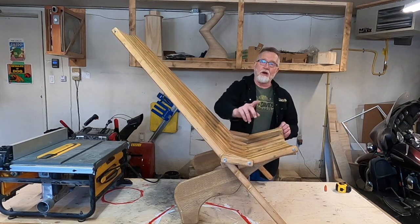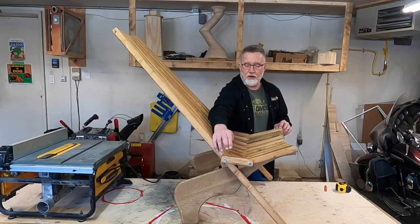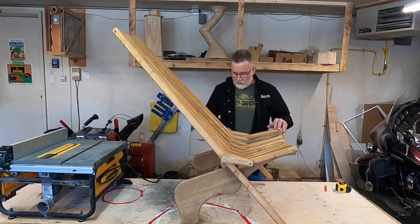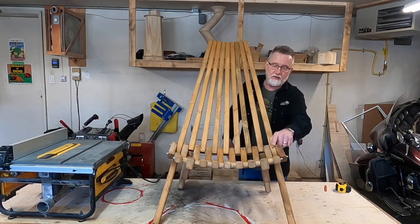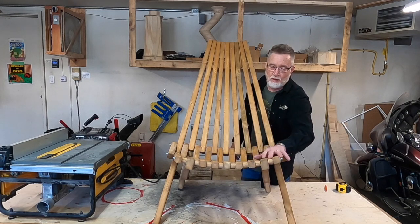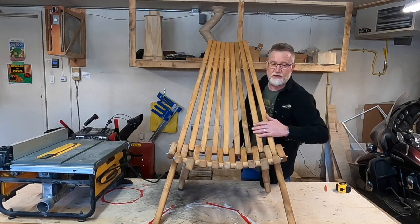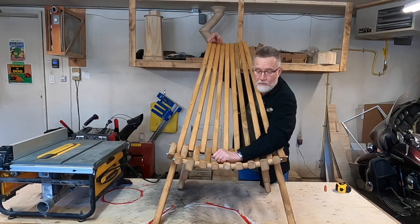The rods are 1/4 inch threaded rod with a bolt on, a nut on each one, and then a locking nut on that, with washers. In the middle here, on the original one I saw, it did not have these spacers, but what I found, without the spacers, it's too close together and it's actually a little uncomfortable. So there's doweling in here too. The dowel is just inch thick dowel, and we just use them as spacers in there. So those are the dimensions. I'll put them in the description below, so you have them all, and then we can make them all up.